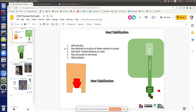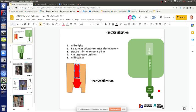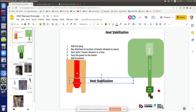I see that there could be two approaches. One is we use an equation to determine the temperature internally of the pipe from a measurement on the perimeter. And two is that we use some sort of internal temperature measurement device, because otherwise we're just getting the temperature on the outside. Right, the temperature on the outside could be 300 degrees Celsius and the temperature on the inside like 200, not even enough to melt the plastic.